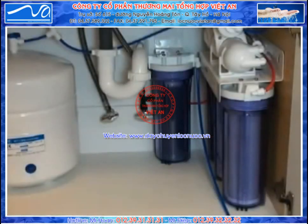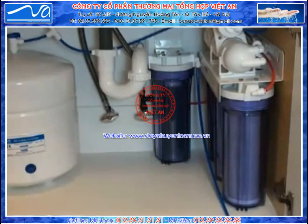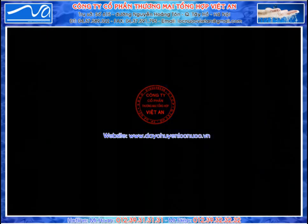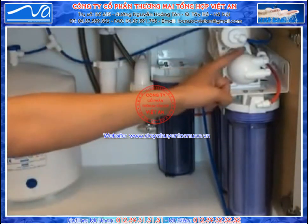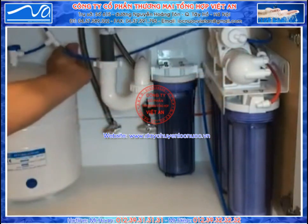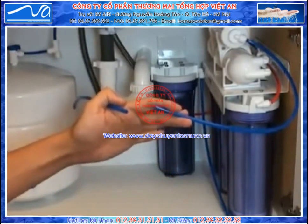For a typical drinking and reef system, you're going to add the deionization canister. This will further purify the reverse osmosis water and create zero TDS water suitable for aquarium use. Many people choose to not drink deionized water because it's debatably unhealthy and certainly expensive. Because of this, we're going to tee the system off so only the fish tank water will go through the deionization canister. The first thing we're going to do is remove the line between the pressurized tank and the RO system. Push in the ring and the fitting and pull the tube out. We're going to clip the line in the middle and then install a T.